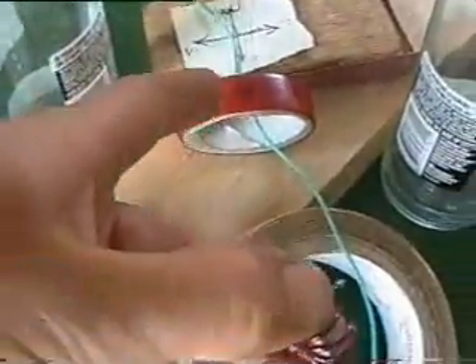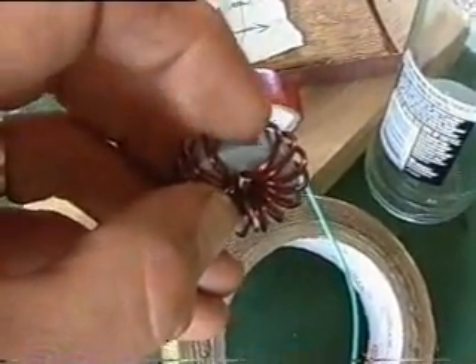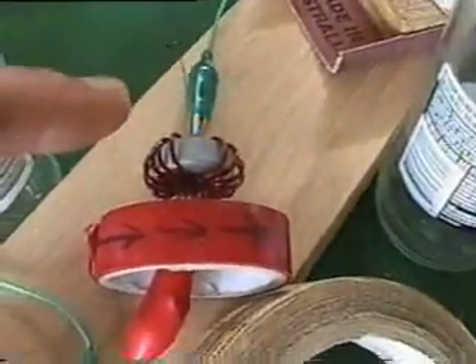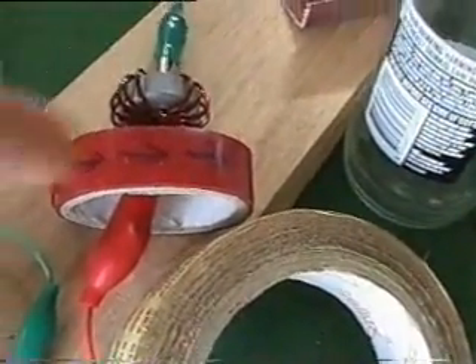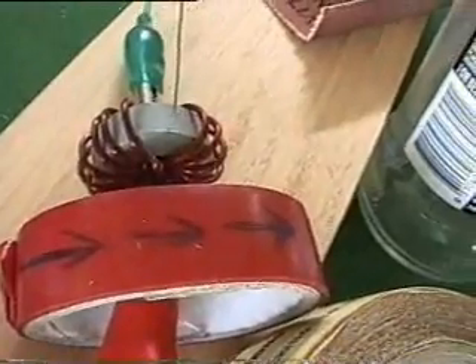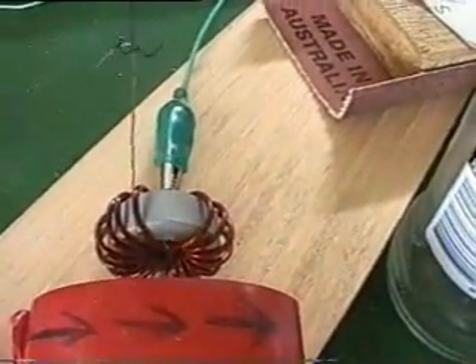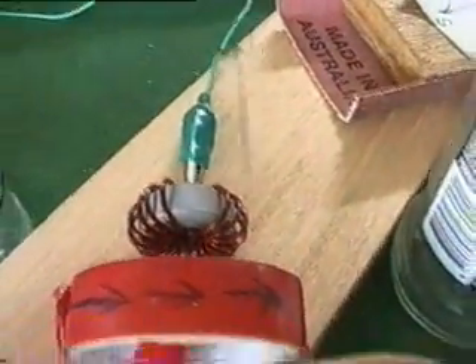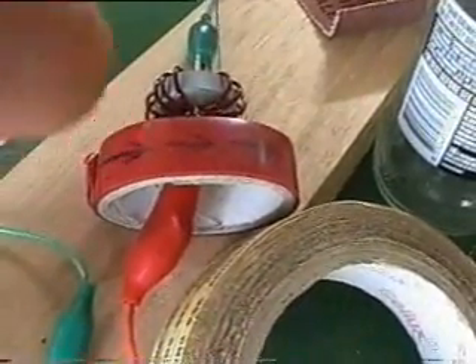Now I'm going to replace the wire with the toroid coil, and I'll hang the needle over here and we'll see if we can make that move as well. I've got the toroid set up so that the magnetic flow in the core is going in the direction of the arrows, and we can prove that again with the needle — it'll swing in the direction of the arrows when I tap the battery. That's showing the current in the magnetic field in the core going in the direction of the arrows when it's energized.